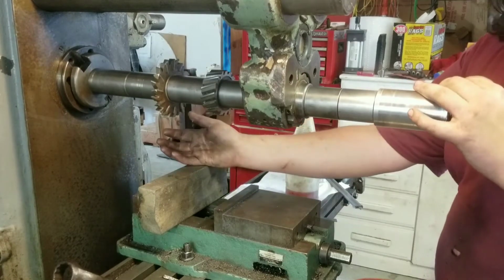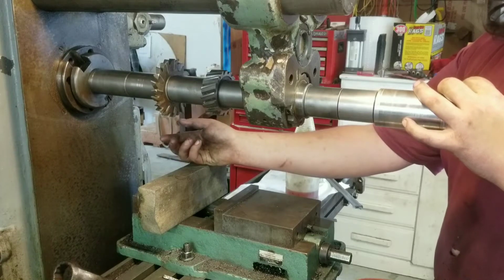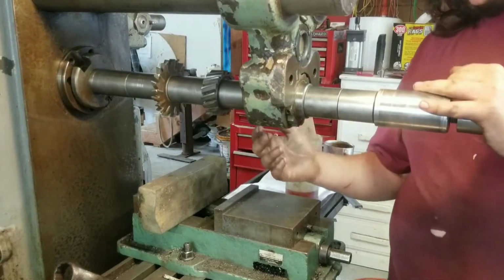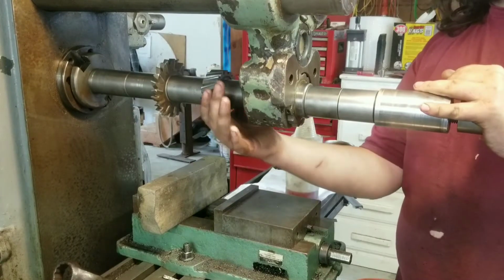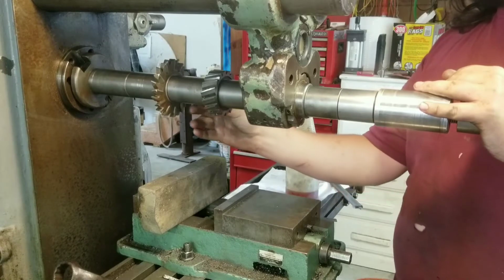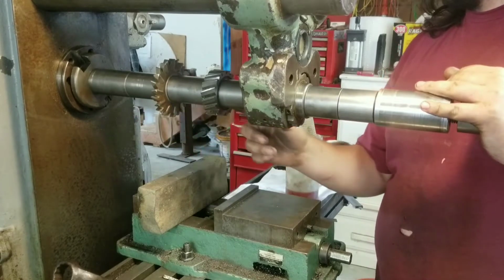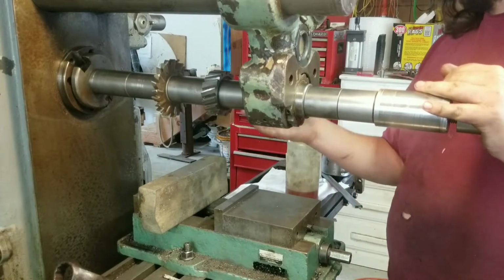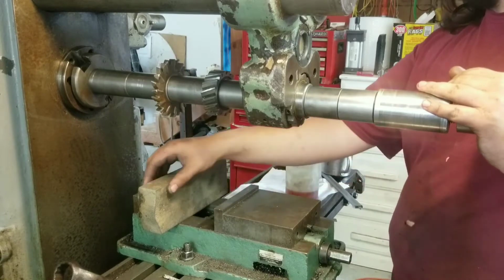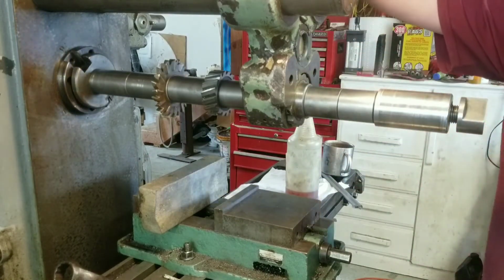However, I've been using that cutter quite a bit, and so I would like to transfer some of the wear to my other cutters, so I'm not using just one. Because of that, I have a 3" in diameter by 1" wide cutter here, and a 1/2" wide cutter by 4" diameter one here. The 1" wide cutter will surface the top, and the 1/2" wide will not only cut the sides, but also the slots for the T-slot and the cross slide.